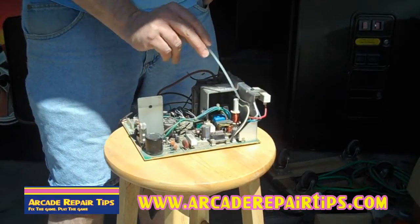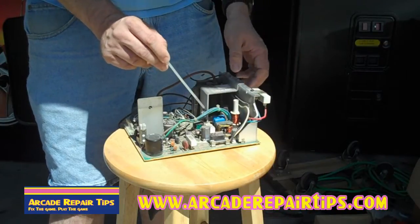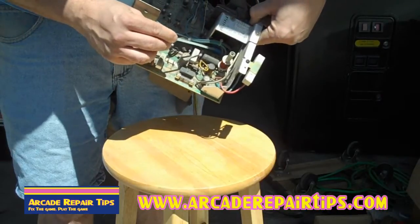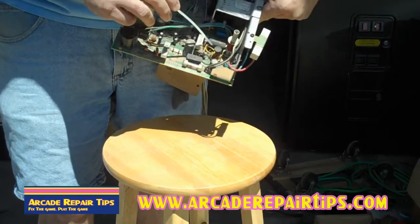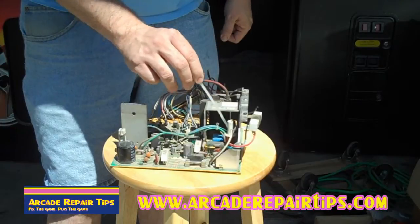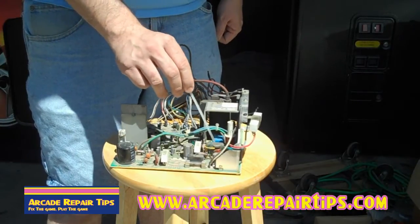Let's say that you're adjusting this width coil, which is right here, but it's not really helping much. Well, Bob Roberts sells a cap kit for this. These are the caps in your horizontal section that you need to replace. They don't look like these caps — they look like these caps. You guys have heard me say that they look like really big chiclets. Those are the caps that control that horizontal width. So you may need to get a cap kit from him and replace the caps in this area. They're kind of sideways — they're not a tantalum cap. These caps that are long like this have to do with the horizontal width.